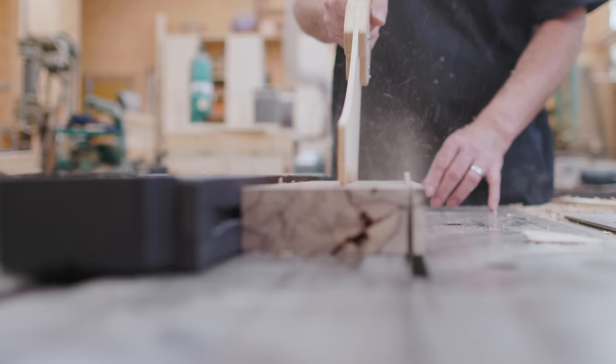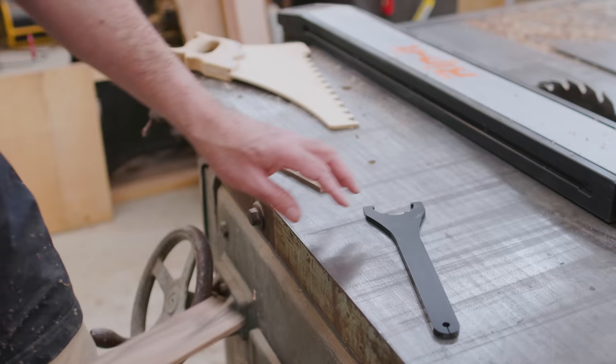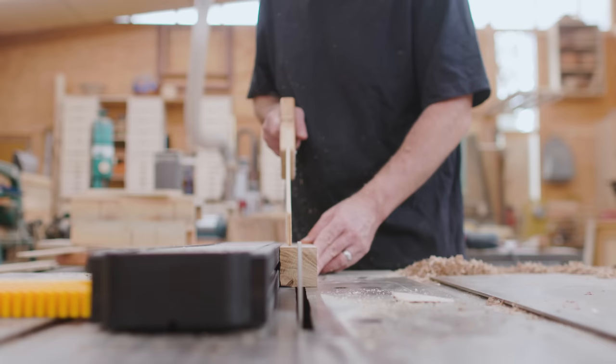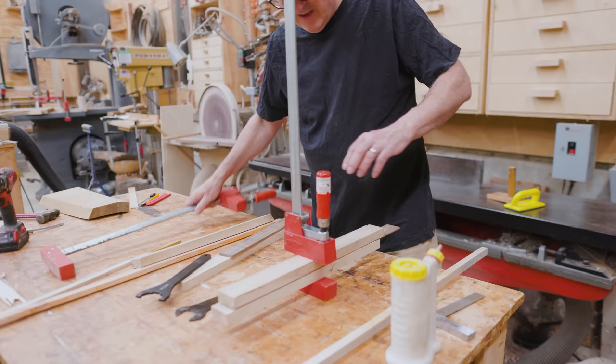So my thought is to cut the piece of oak in half and insert sort of a filler piece that's the thickness of the wrench. Then I can clamp the handle to the wrench with two bolts. I found a piece of walnut I could use for that filler piece. I cut it and then planed it just to the right thickness, keeping it just the tiniest bit thicker than it needed to be. Then I could cut the piece of oak in half, found the center, and glued the spacer piece to one side of the oak, making sure it's the right thickness.